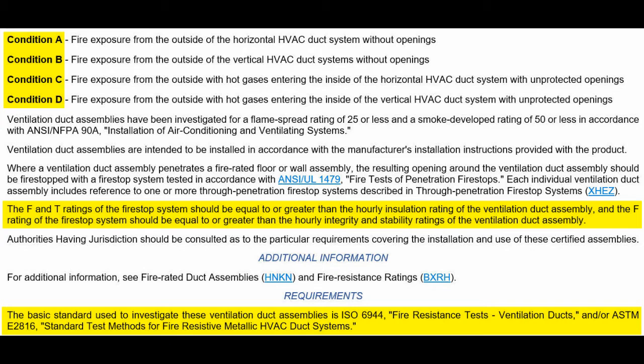So if I fatten up the insulation at that point, I can push the thermocouples out of the danger zone. I get lovely thermal data, and that's the only thermal data I get. I don't get any data in terms of what heat arrives inside. If I want to know what heat arrives inside, I use the test method for grease ducts, or the test method for electrical circuits, that's the best one. They put lots and lots of thermocouples on the inside to safeguard electrical circuits. That's the point. And you have a level change from horizontal to vertical. In one test sample, you've got 4 changes of direction.